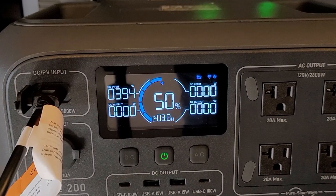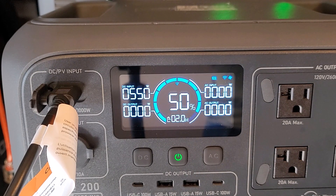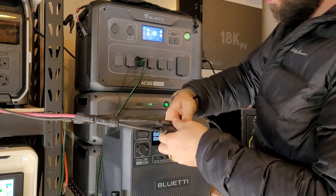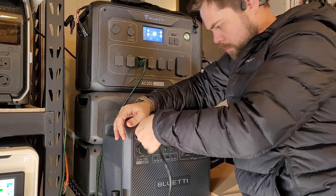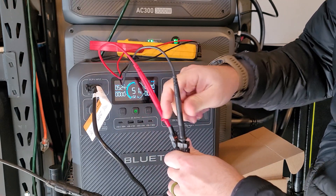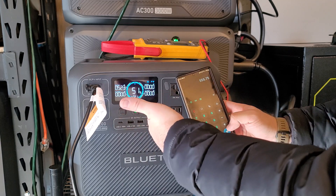I connect it up and voilà — I've got solar input. I was pleasantly surprised to see that this got up to 550 watts, and that's only on one of the two solar inputs. To verify, I added MC4 branch connectors and an XT60 adapter to check voltage and amperage. Using my clamp meter I'm getting 19.5 amps going into the system, and using probes I can see about 28.5 volts input VMP. So 28.5 multiplied by 19.5 gives 556 watts — very close to what's reading on the screen.